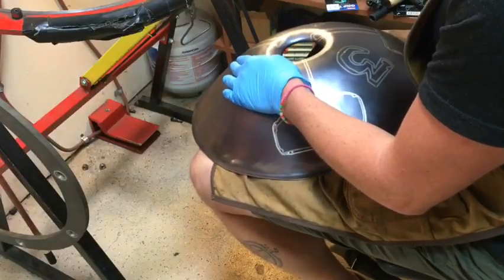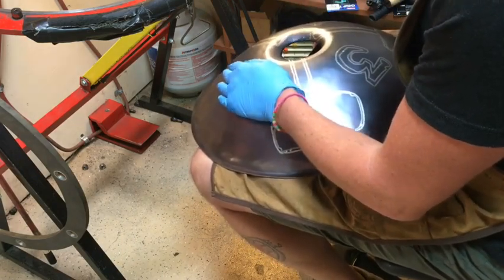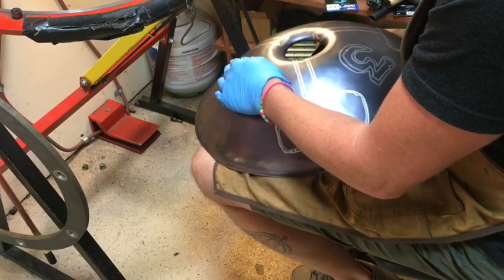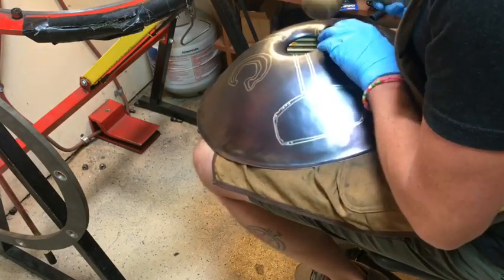So I was thinking with the top shell in D minor, I was probably going to do a D minor triad in the bottom, but then this port came in really sharp, and so I realized I maybe had the opportunity to do the relative major, which would be F major. It came in high enough that it was pretty easy to get the F major out of it, which is F5, A5, C6.